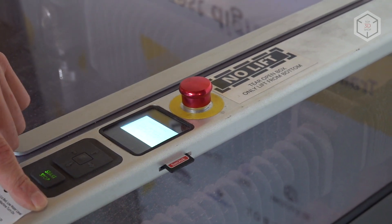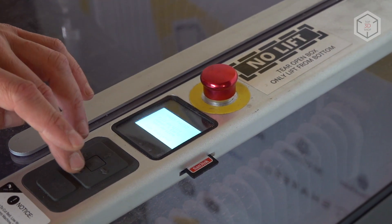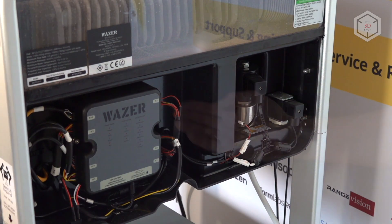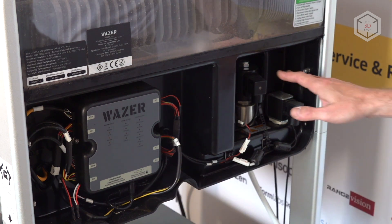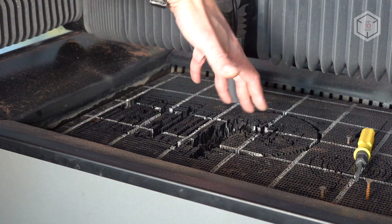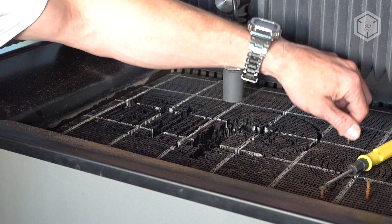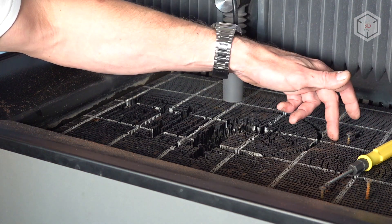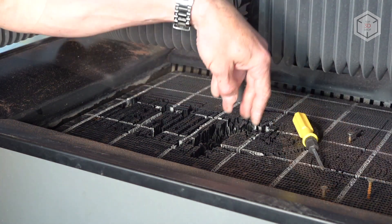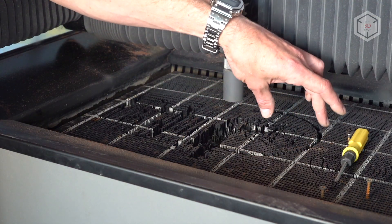The controls are located on top and embedded into the frame, comprising an LCD display, card reader, control buttons, start/stop, and an emergency shutoff button. The electronic components are located under the sidewall, including the main driver and two solenoid valves — one for inflow and one for draining. Workpieces are easily and securely attached to the cut plate with screws. The large thickness of the bed and its cellular structure help absorb the high impact of the water jet. The bed is partially immersed in water, with the level maintained within strictly defined limits, and has markings with three-inch steps for easy reference.